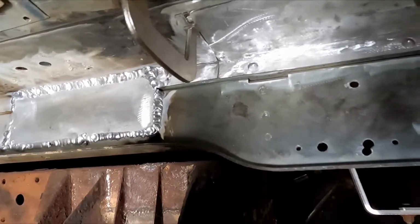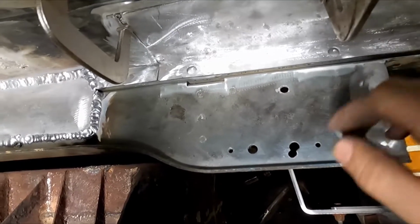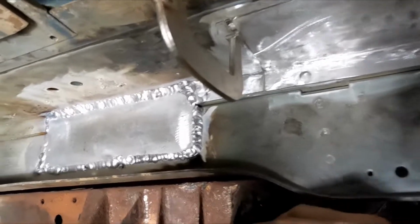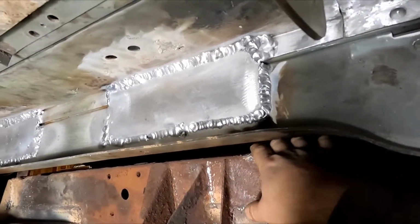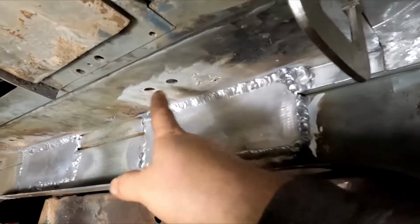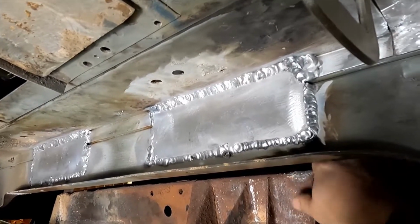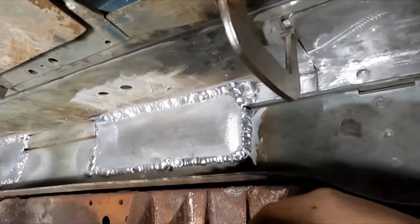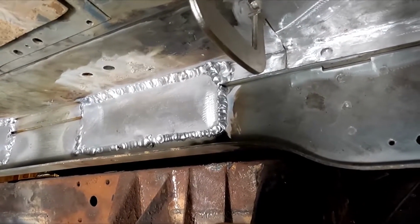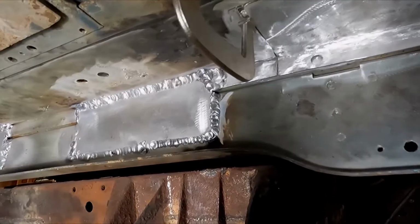And I'll cover it with zinc chromate primer because I have it from an outboard, and it seems like the right thing for this. I think it's zinc chromate. It's for aluminum only. And then up on top of here, which is really accessible as you can tell, there's a funky bracket that goes from here to here, and then another bracket from the back to there to mount to the frame so that your seatbelts don't rip out of the aluminum the minute you hit a stop, and it makes it safe. Safe is not this vehicle, but that's okay.